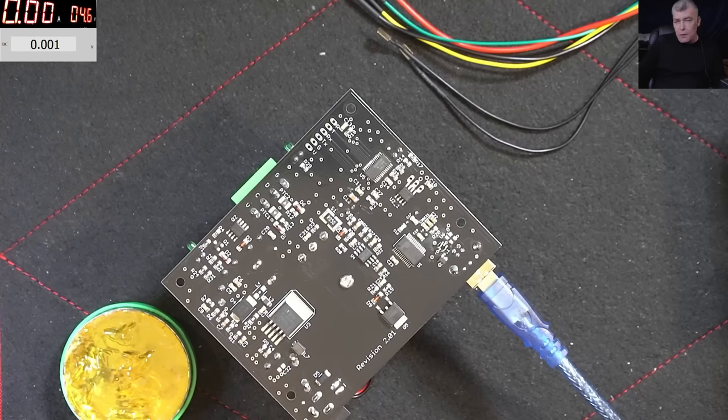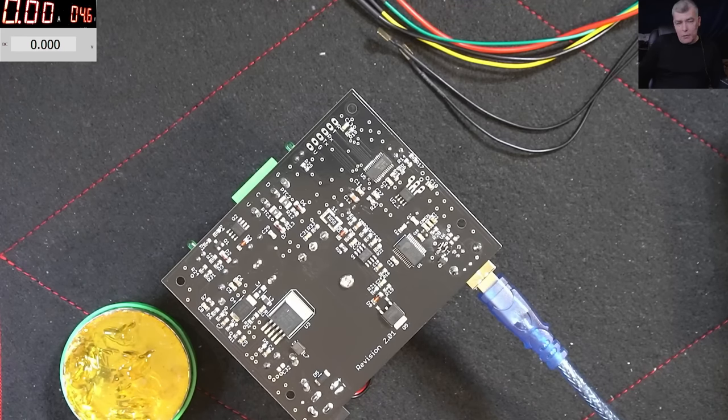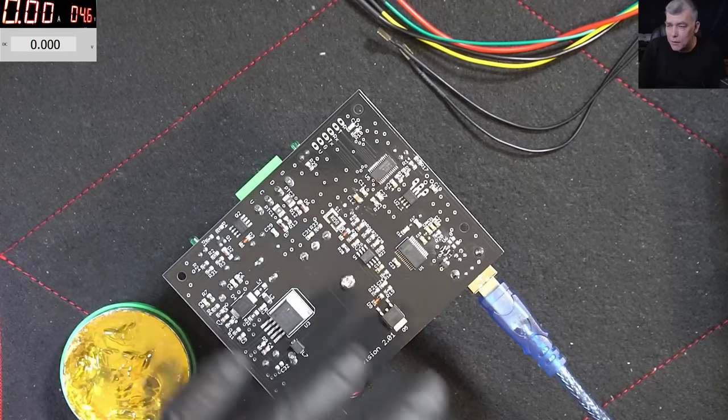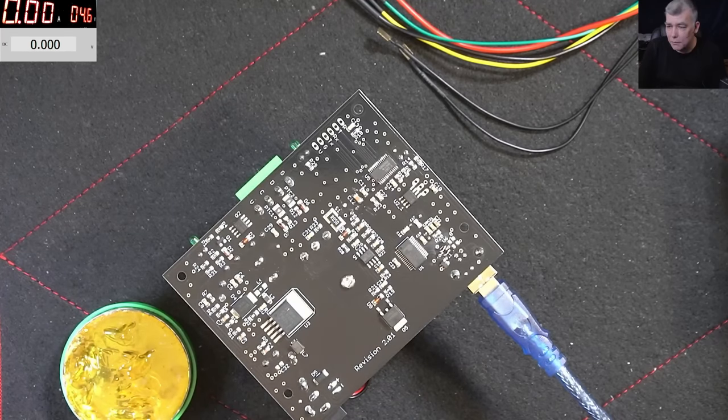And you know how I think this chip got burned? Probably because of the potential difference between the solder iron and the computer. Because obviously here the ground is from the computer, yeah? And the solder iron, you have a different ground. No, 100% has a different ground.